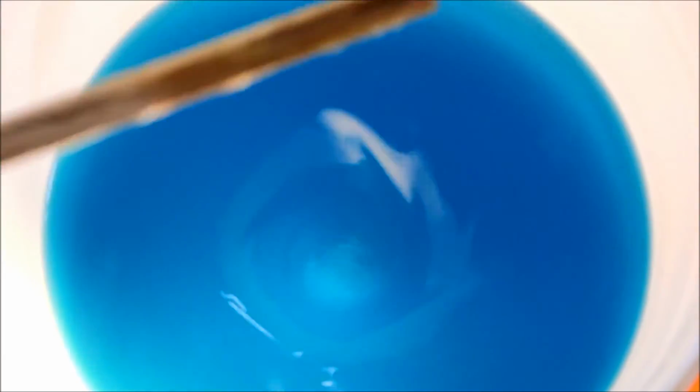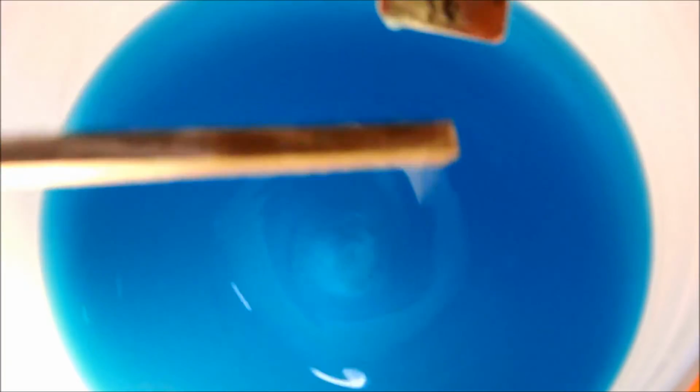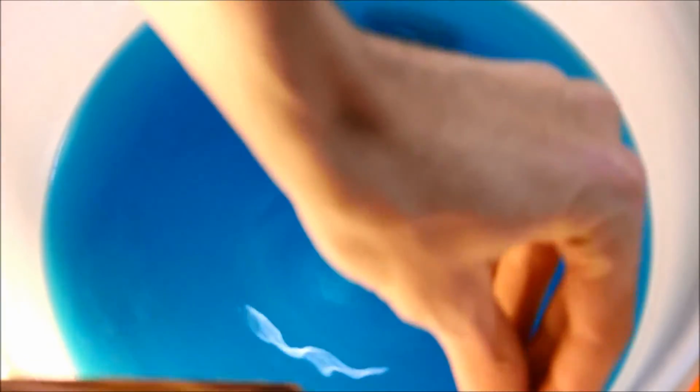It's been about 30 minutes. Time to check. So it's this board. I'm gonna touch the acid. Oh my god! Just kidding. This board is almost done. You can kind of see the red bits, the orangish red, coppery looking bits. Those need to come off. So I'm gonna flip it over a little bit and pull it back down. And see how the other ones are doing. That one looks about the same, so I'm going to flip it over.